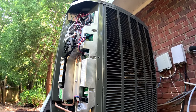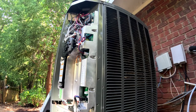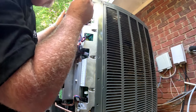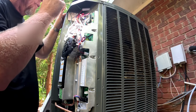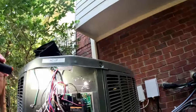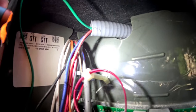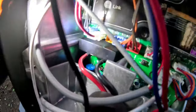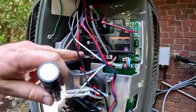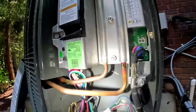I haven't laid my hands on one of these yet. There are some similarities to the old one — if you want to call it old, it was only out for a few years. Then they changed it a bit and now they've done this, which is strictly Trane Link. One thing I'm noticing up here — the cobwebs have a blacky soot on them from something that burned or smoked or shorted, and I can smell it when I get right up in this area. The thing also lost communications and it wouldn't work.